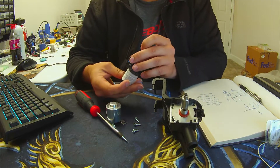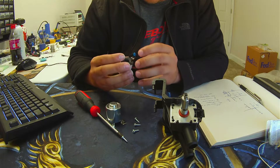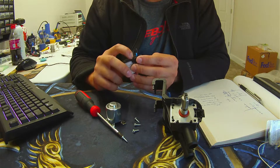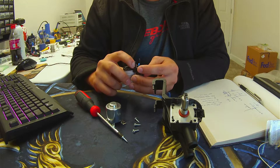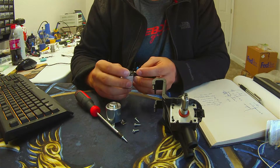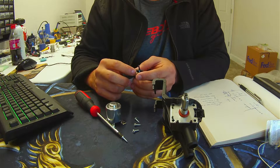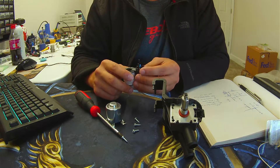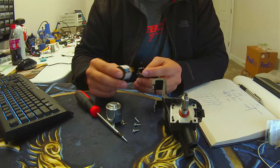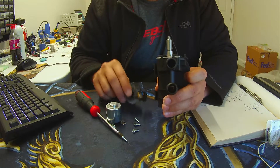It's got a capacitor here, which is good, but it does not have a diode. So what I'm going to do is probably add a flyback diode here in parallel to the capacitor, and that'll just keep any sharp voltage spikes from tearing up any of the electronic circuitry. When you quickly disconnect an inductive load from a relay or something, at 12 volts it could spike to like 900 volts — the energy stored in the coil needs to be dissipated. A flyback diode keeps that energy circulating through the coil until it dies down. Plenty of room in there to add it too.